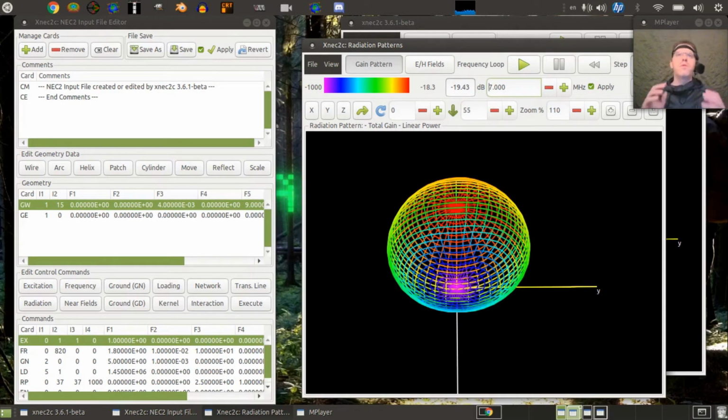The problem is that maybe your antenna tuning unit won't really like this short antenna. You could end up needing a lot of inductance. So the inductance coil in the antenna coupler in the transceiver, or the external antenna tuning unit even, you could have a hard time matching short antenna wires. So that's why you basically need to change the length of it. You could obviously wind up the antenna. If you roll it up tight on a winder or something, you can have basically the same result as this, if you don't want to use links in it.